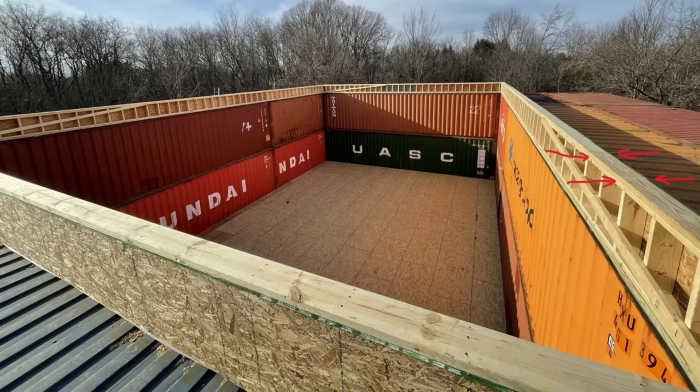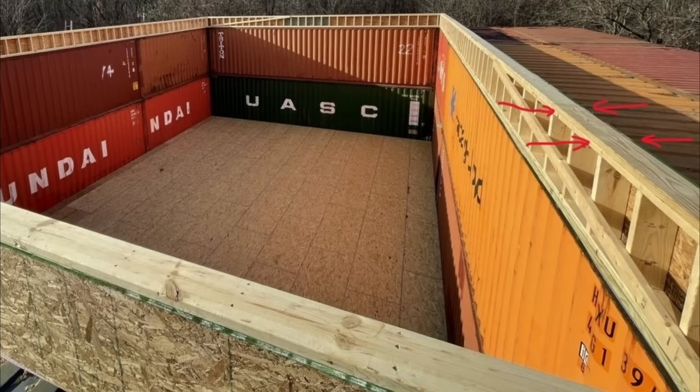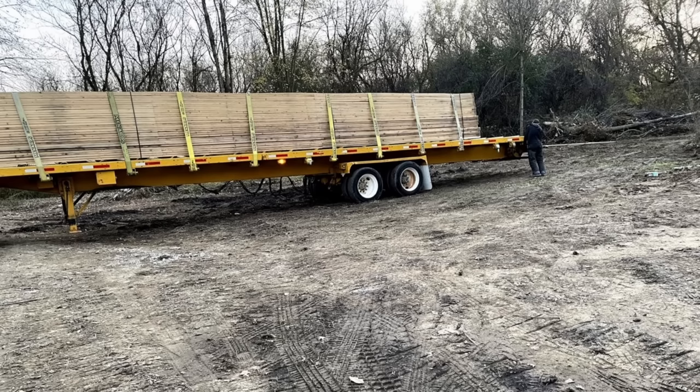But when I went to Menards a couple of years prior, telling them I needed trusses spanning a 40-foot space, they said, oh yeah, we have standard 40-foot trusses. They didn't ask to see the architectural drawings, and I didn't know better. So the trusses that I was protecting with tarps in the snow were essentially useless.